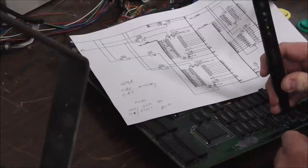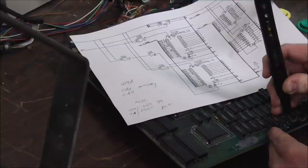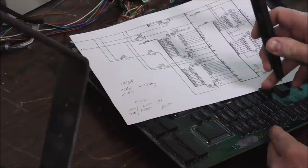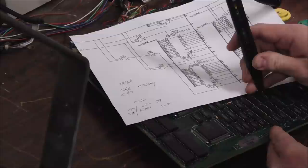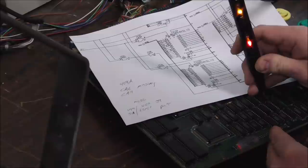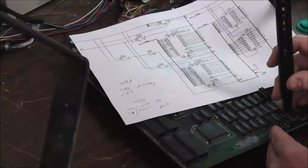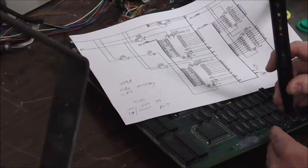Where that signal comes from is U59, pin 5 is the output — it's an LS151. So J11 — by the way, there's a typo in the manual, it says J10, but if you look there's another chip right below it that also says J10, so J11 is the right one. J11, the output is pin 5: we get no output. The screen goes crazy when I do that. Pin 6 on a 74LS151 seems to be the inversion of that — it's not outputting anything either. So I've got nothing on pins 5 and 6.